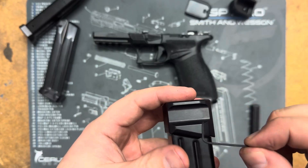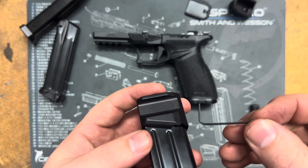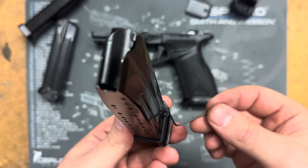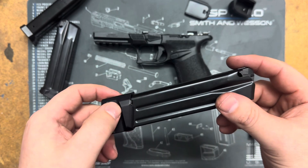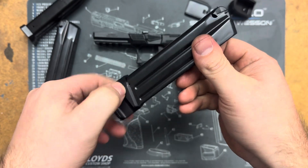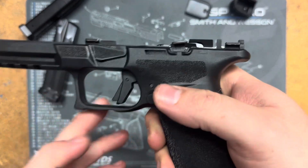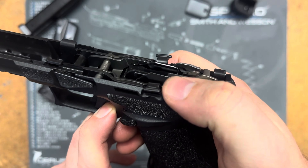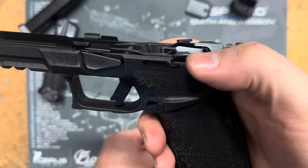Try to make sure that the wrench is nice and deep inside of the screw. If you try to do it when it's not good and deep in there you could start to damage the tops — not really the head of the screw but where the teeth are — and if you do that too many times then you might have trouble actually backing the screws out or driving them in to remove the extension. So it's nice and tight on there, those are nice and protected under that lip. These also push in nicely; they do have a little bit of movement back and forth, but it's not actually putting pressure onto the ejector no matter how hard you slam it in, so it's not going to over-insert and damage that ejector there.